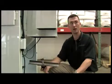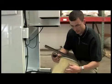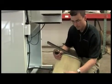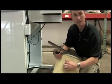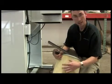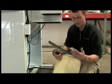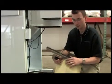So here's our cartridge filter. Make sure we inspect it. Look for nice clean pleats. You don't want any dust, any grime, hardened areas, once again, very dark areas. If you see a lot of dust on the outside of the filter, that's usually a sign that it's not filtering through. So that's the time to replace it.